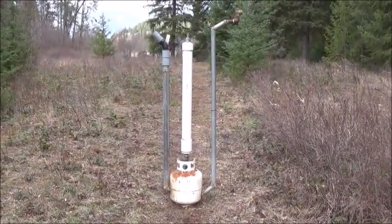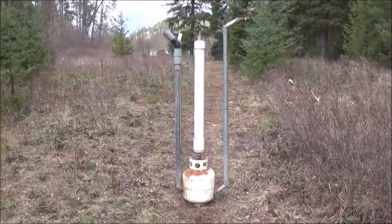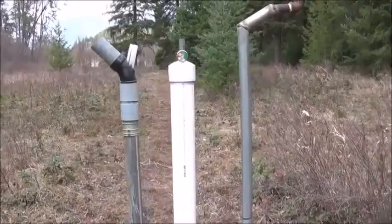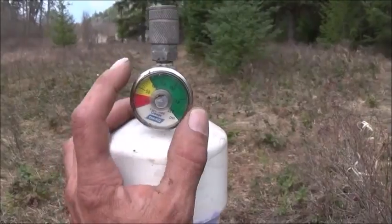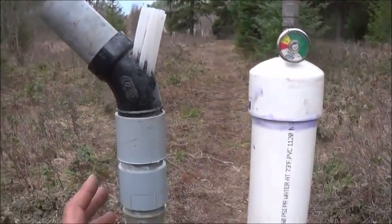By mixing the two together we're going to end up getting something that produces a much higher compressed air value than the Tromp by itself. I noticed when messing around with the water ram that I was able to generate, with very little head, up to almost 60 PSI, which shouldn't have happened given the amount of flow and head I had. So the water ram effect was able to generate higher PSI than the Tromp design all by itself.